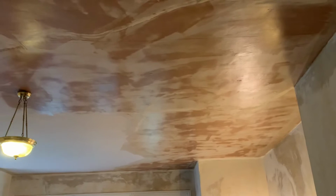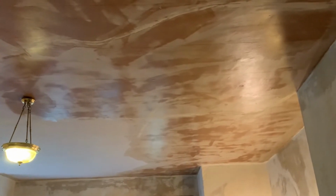Today I want to show you how I use Zinsser Gardz Problem Surface Sealer on my wallpapered ceiling to seal it all up and prevent plaster problems that might come from trying to scrape the wallpaper off the ceiling. Let's go. This is my ceiling. I've got it half painted with the Zinsser product. It's a plain wallpaper that's just white, and when I put the Zinsser on, as you can see, it starts to look, I think, like vellum, like an old leather.